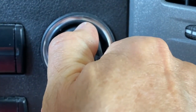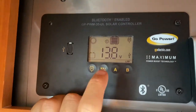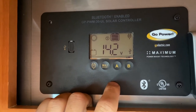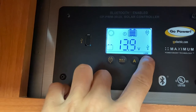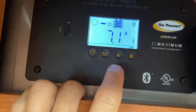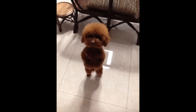Now I back up the RV to get some sun. It's pretty cloudy but I'm at about 93 percent full and 14 volts. Usually the old solar controller wouldn't charge the battery bank because it thought it was already full, but right now the new algorithm allows it to properly charge the lithium battery. Everything is working just fine — I'm very happy, and it's been a very simple and straightforward upgrade.